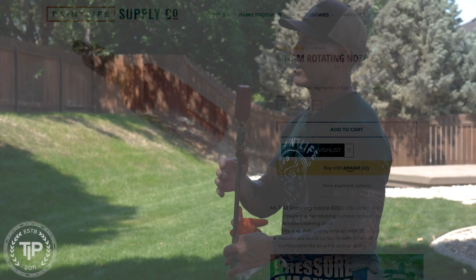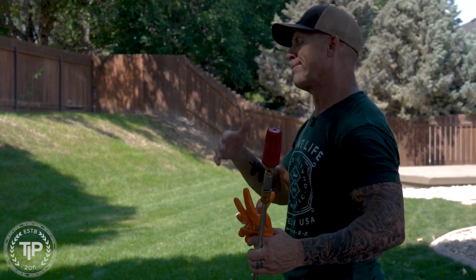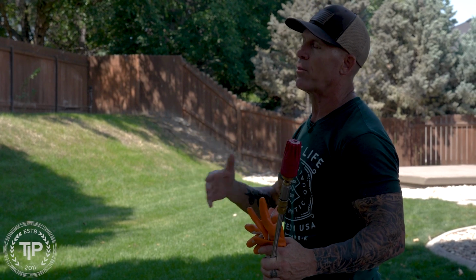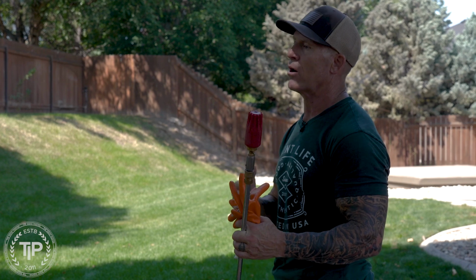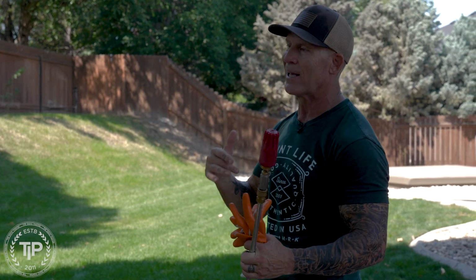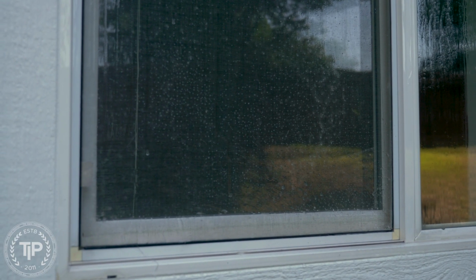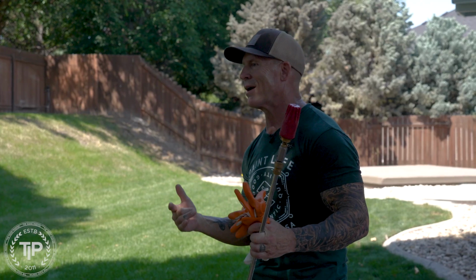Now, a lot of the screens are gonna be oxidized, pretty old, so really stay pretty far back from the screen until you're comfortable you're cleaning it, but not actually leaving stripes or marks on it, because they can be very fragile when oxidized. And I actually striped one of the screens on purpose so you can see what happens if you get too close, because I'm going to rescreen it. So I just wanted to give you a look at what it looks like.